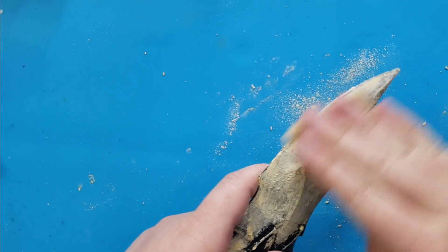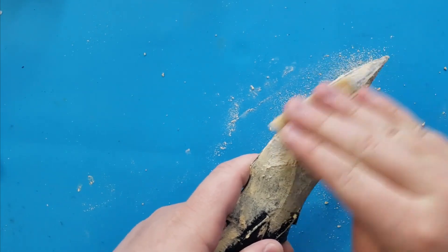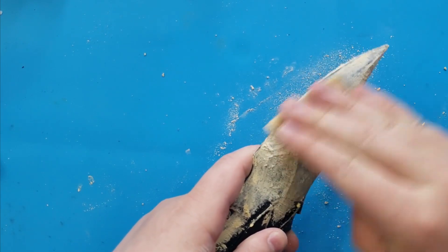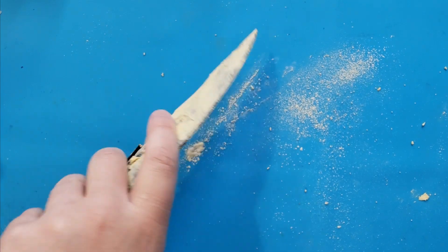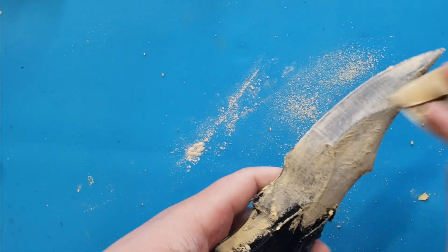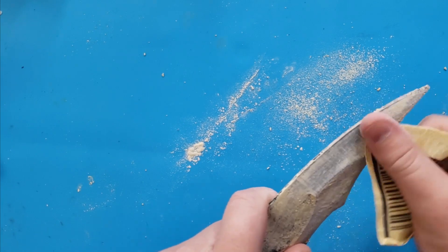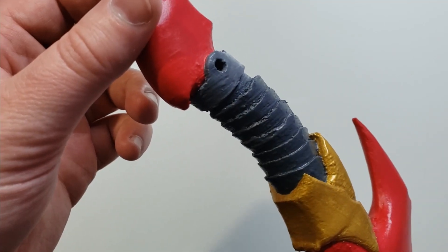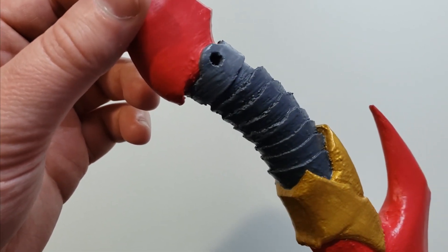Afterwards, I did a round of sanding with my Dremel tool, applied some wood filler, and then did some hand sanding. I didn't need to do as much sanding as usual because these prints were great quality, at least in terms of my printer. While I was fixing it, I discovered that printing only one piece at a time drastically reduced layer lines, although it did take much more babysitting. The handles and some of the other details ended up being a little bit rough — I couldn't effectively sand some of this, but it looks alright.